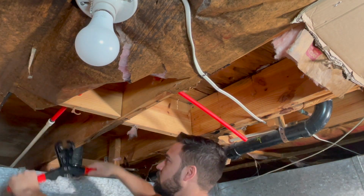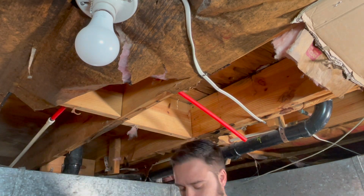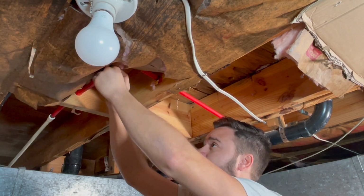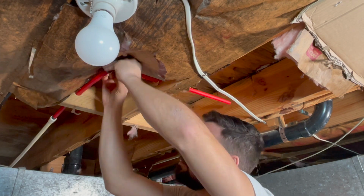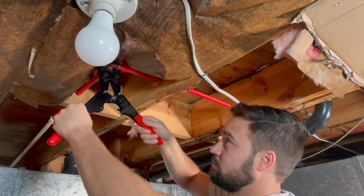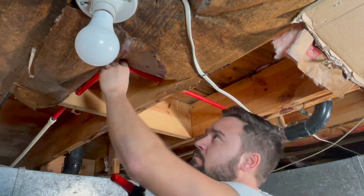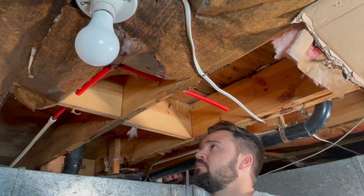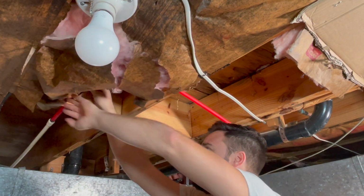Then it's time to crimp the PEX into the fittings. I like to use a small channel lock or a needle nose to squeeze the rings first so they stay in place, and then you just crimp along. And as always, make sure to check with your go/no-go gauge all these fittings.